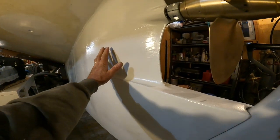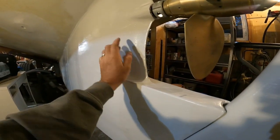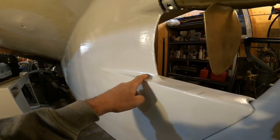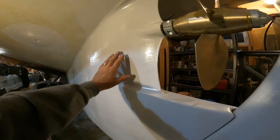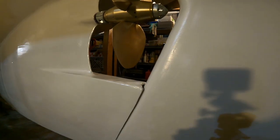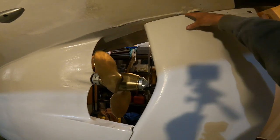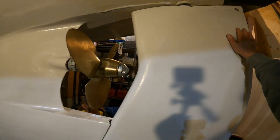Speaking of fairing — my aperture always had a pointed trailing edge which is good for water flow, but there were some facets and vertical welds that were quite ugly. The interface between the horizontal plate and the vertical was just a hard 90-degree corner with an ugly weld. I went ahead and faired this using Quick Fair, an epoxy-based filler that works well with aluminum. All these joints got faired fairly nicely, so I now have as clean a hydrodynamic exit from the keel as possible. I also did a little fairing to the rudder — the triangle shape ahead of the rudder's axis of rotation got smoothed over for good water flow across that part.